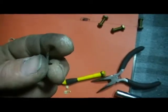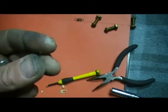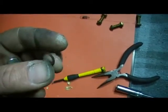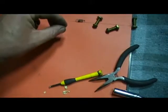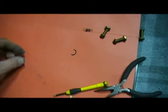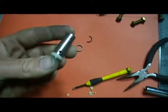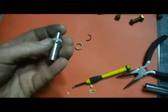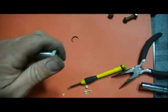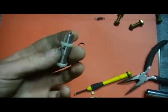It's simply a washer made out of Bakelite, a very small one, which was slid over the end of the solid shaft that was turned down a little bit at each end, and glued on with some sort of a resin-y glue. Now I've cleaned the shaft up. I've decided not to reproduce a Bakelite washer and instead I've turned up a couple of nylon ones. Here's the shaft — it's a nice push fit but I will be putting some Loctite or something on it to stop it sliding off. It's a bit grubby at the moment because it's just come off the lathe, but it'll clean up nicely and go back into the relay.